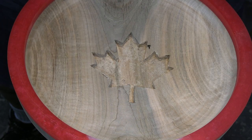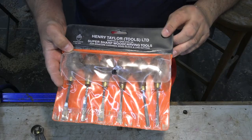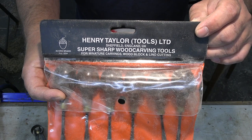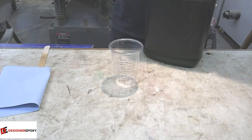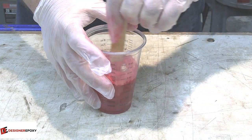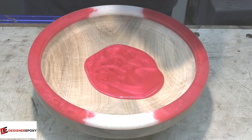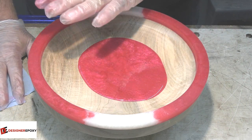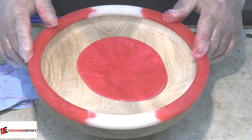Well, it isn't perfect, but not bad for somebody that doesn't do any carving. I'm going to pan this out and show you the kit — I think I got it at Lee Valley or Busy Bee here in Canada a long time ago. All right, let's mix some resin up. Here we are using the ArcCast again, and of course we're going to be using the same Pearl Red that we put on the rim. I think I mixed up about six ounces. I know that there's a lot of resin there — I don't have a ton of thickness on the bottom of this — but the goal is just to trim this excess off in the morning. I'm going to throw this in the pressure pot overnight.